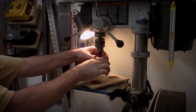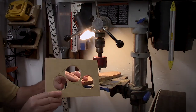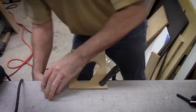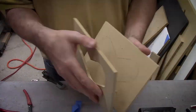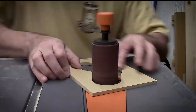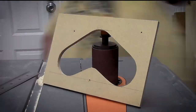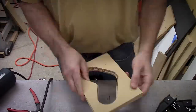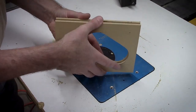Still working on some templates. These are quarter-inch MDF templates, and MDF was a very affordable thing at one time — now, just like everything else, it's expensive. I'm doing a double thickness or stack template that has toothpick pins that hold the two pieces together. I finish one thickness, rough out a second thickness, and then use the router with the pieces pinned together to make a stacked template.